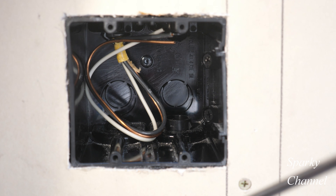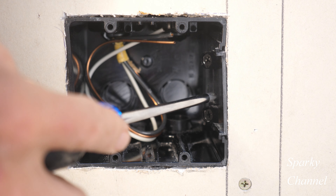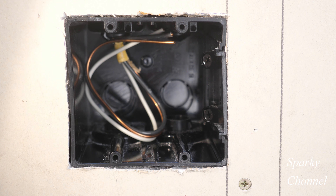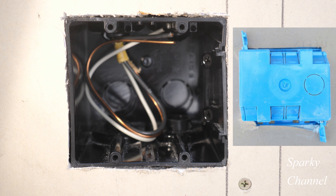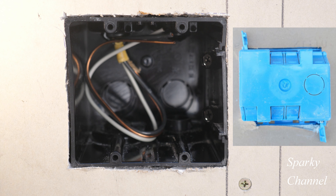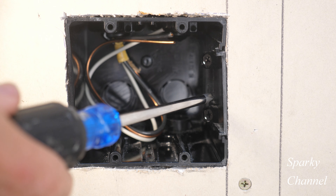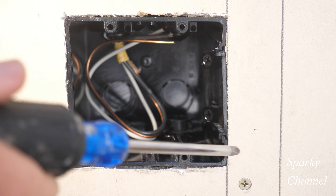You cut out your hole, and there are two screws right here that screw into the stud. I was pointing out that it makes a much stronger box than the old type of old work boxes that have wings on the sides — those have the advantage of going anywhere on your drywall. But if you have access to a stud, it's stronger to screw into the stud.